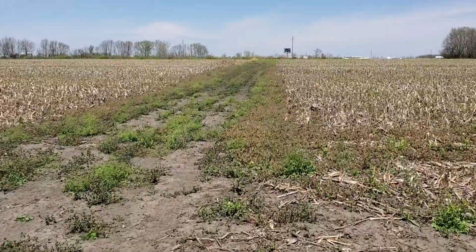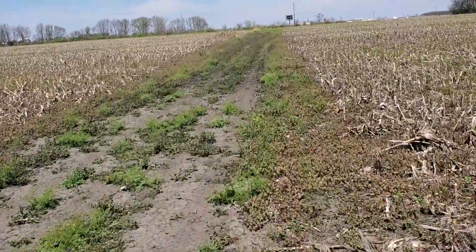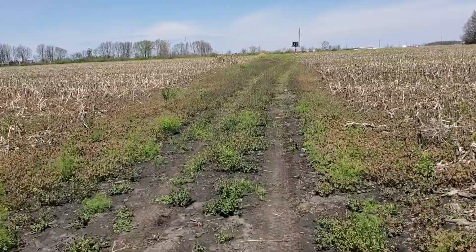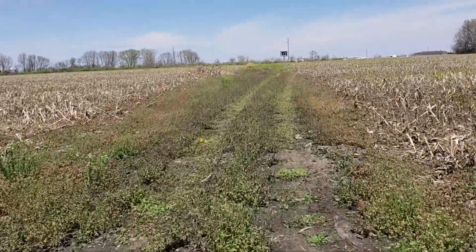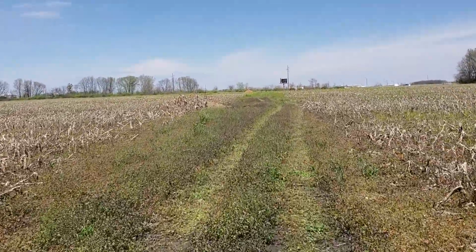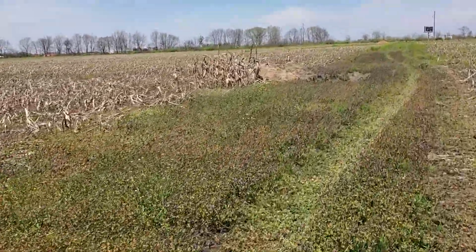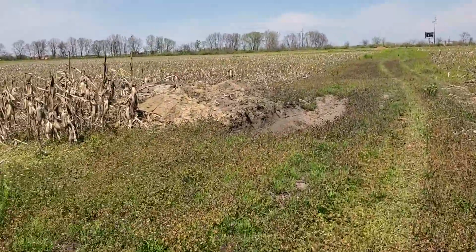That pit 2 up there, if you dug down through there, was predominantly all browns. We had some lighter browns, so we had some mottling. So that second pit there was a well-drained hole, leaning towards moderately well-drained. This pit 3 coming up was a transition down into the very low spot. So it also had a little drainage issue that went somewhat poorly drained.